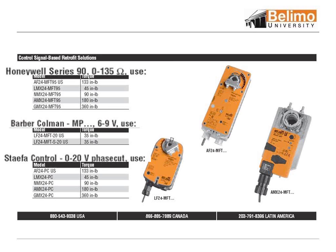On the Honeywell Series 90, we see a lot of the mod motors — the old square box motors. Keep in mind when you're thinking about going to what might have otherwise been a $600 motor, you can enter the retrofit in the AF series for probably less than half that cost — both on dampers and on valves. Really what drives this is what's the signal controlling it. In a retrofit situation, if you're going to stay Series 90, then you need Series 90. If you're going to retrofit the thermostat, sometimes it makes more sense to retrofit the thermostat with the motor and just go to a more modern 2 to 10 volt DC.